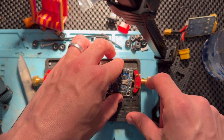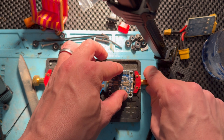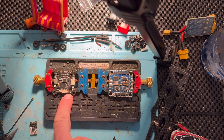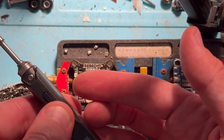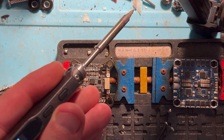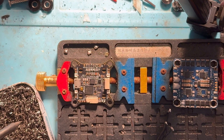We'll start with some re-soldering because a lot of tutorials out there show people soldering new stuff, but that's not really realistic. In the world of FPV you're always out there fixing stuff. So this tutorial is going to cover both new and existing connections — I'll wire up some motors, I'll wire up some of the thinner wires, and I'll show you exactly what I'm doing. We're gonna set the iron to max — I always just put it on 752. When we hit around 500 degrees that's when the solder actually melts.